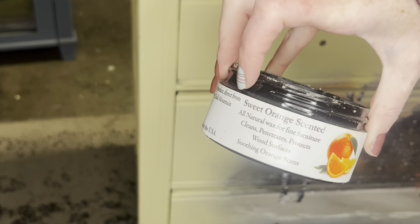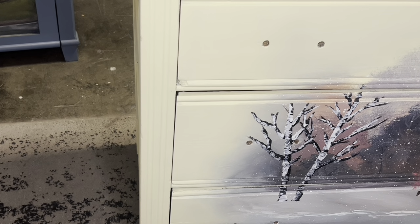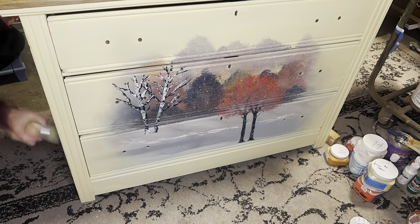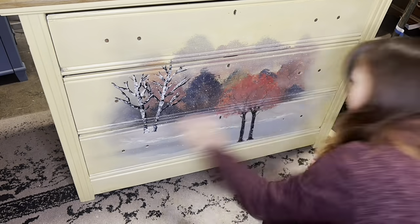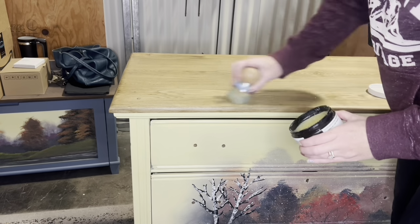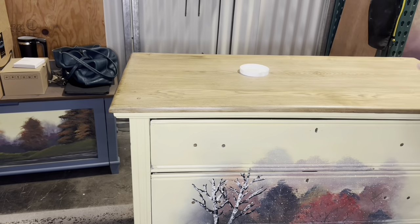So I'm using the orange scented wax in this case, and I'm sealing the entire piece in this. And then if you've been watching my channel for a while, you know that I will also do the top because I like having a poly and wax on the top of my pieces that I know are going to have some use. I just feel like it's a better, more durable finish.